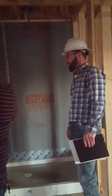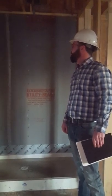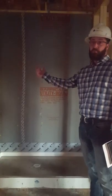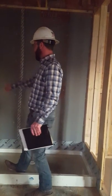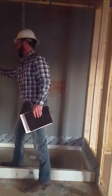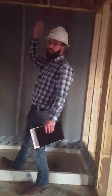And I hate we never asked this before, but y'all didn't have an option where we would have multiple shower heads in the shower, right? I don't think a rain head is... No. Nope. That's something we'd probably have to do later. Yeah, and I was thinking that's just going to be an expensive upgrade. Well, we should have asked about that a long time ago. The thing about it is, if y'all ever decide to add it, you can always add it from the back. I mean, you can drill a hole saw in the tile, but you can open up this back wall, add the other diverter, run it up straight to the top plate, go up in the attic, and put it in the ceiling. It's not that bad.